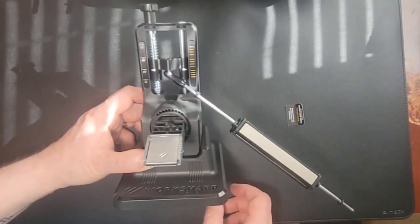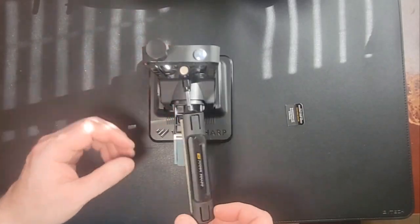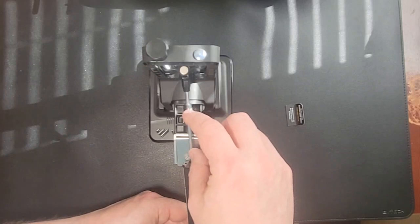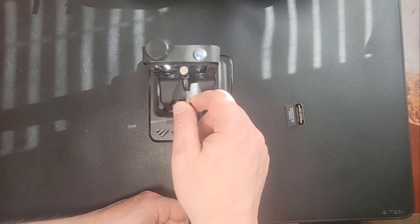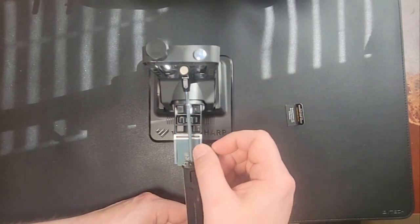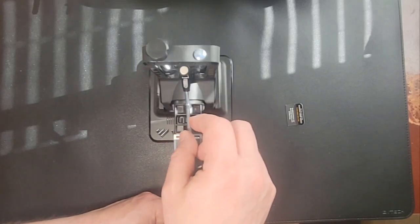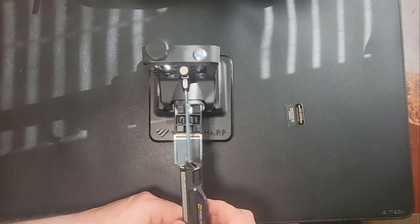You can use an angle cube on the sharpener. It is kind of tricky because you almost have to have the stone down here and put the angle cube somewhere in here. I have these rubber O-rings set to limit the amount of travel that the stone has, to keep it on the blade. But you can set the angle cube there to get your exact angle. They do make a rod that has the angle cube built in, but this model doesn't come with that.